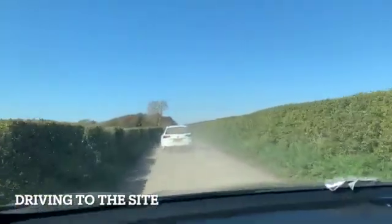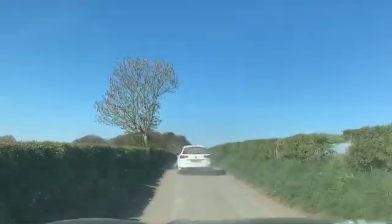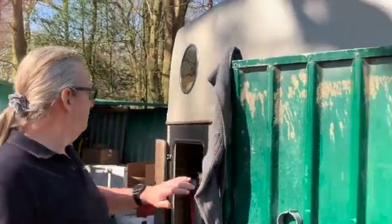We're just heading to the site. This is in the UK. It's actually a system running off a generator, so it's quite remote and it's totally off-grid. Just arrived here - they've got a generator some distance away and they've got a cable connecting it, both a communication cable and the power from the generator. We're going to test the generator first. I actually asked: have you tested the ATS is working? We haven't actually done that yet, so we're going to test the ATS - make sure when we close the connections the generator starts up, and when we open the connections the generator stops.